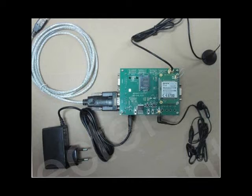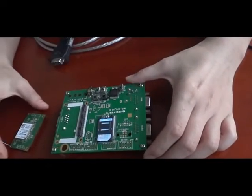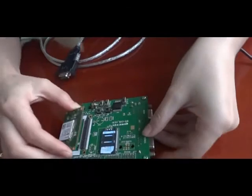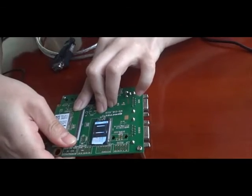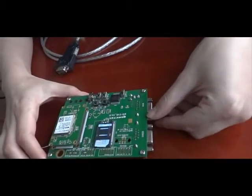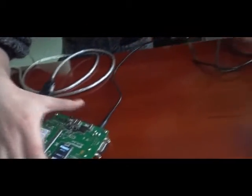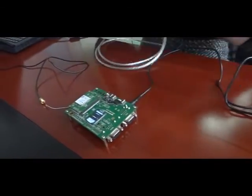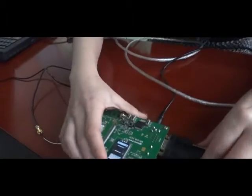This is how they are connected to the EVB. The first step is to connect the SIM card to the EVB, then we connect the antenna. Afterwards, we insert the M95 TEA to the evaluation board. Then we connect the power adapter to the evaluation board where the other end plugs into the outlet. Afterwards, we connect the USB to UART cable, wherein the UART port is connected to the main port and the USB end to the computer.